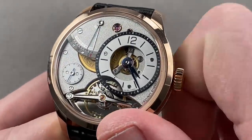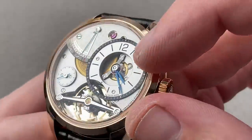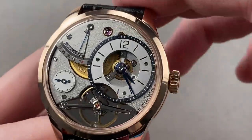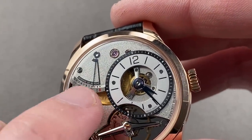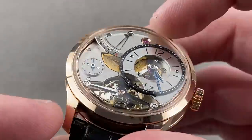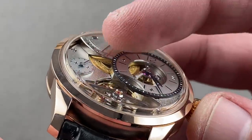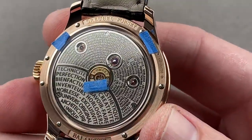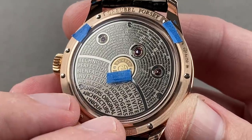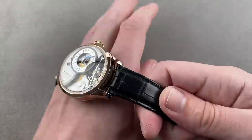The bridges are all nickel, copper, zinc — German silver — that have been palladium-coated to give them a silvery shine. The hands at center are fire blue, sitting on their own lovely tripod hand-finished bridge. We have a power reserve scale in white gold lacquered in red and black, a three-day manual-wind power reserve, and the barrel poking through on the dial side. You can see the quality of the mirrored anglage on the edge of all the bridges, with edges alternately satinated and mirror polished. On the reverse you can see the philosophy en français of Greubel Forsey — only 33 of these watches were made, so it is an exclusive piece. At 39.6 millimeters it is very wearable, and I can recommend it for wrists as small as 13.5 centimeters circumference.